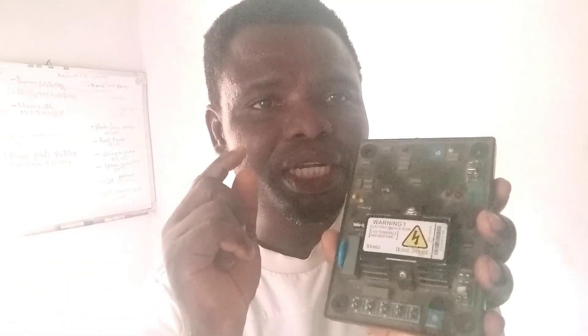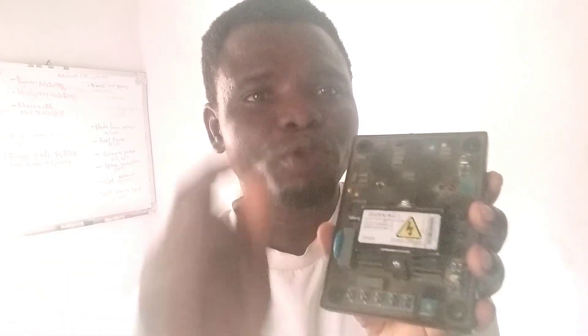Your exciter wire — there are two wires that come out of your exciter. Put the two here: one here, one here. Leave the middle pin. Then there are another two pins — put the two wires that come out from your coil, that is from your stator, into those two pins. Then start the generator and it will produce current.